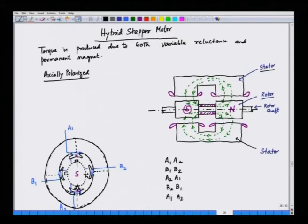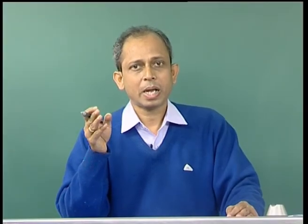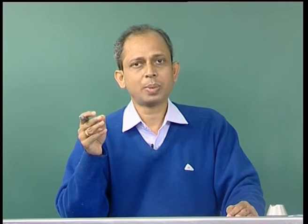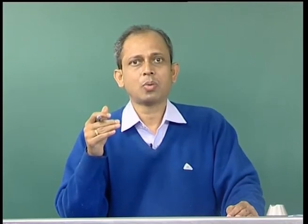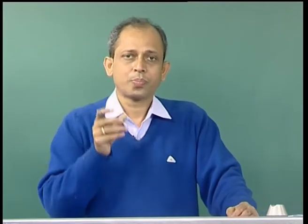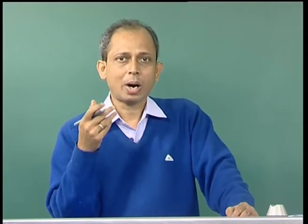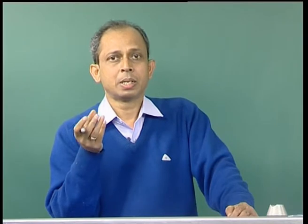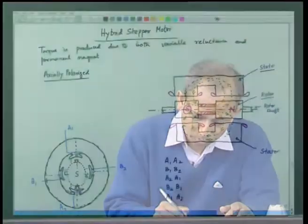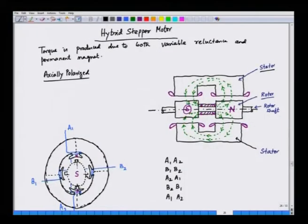Now, when we change from A1 A2 to B1 B2, what happens? Earlier A1 was north pole, and now when we shift from A1 A2 to B1 B2, the phase under B1 will become a north pole. So, when B1 becomes a north pole, the rotor will try to move, and try to move by what angle? Such that the B1 phase will see a tooth. So, in this case we can see here, when it moves in the anticlockwise direction like this, when we excite B1 and B2, we will have a north pole here.